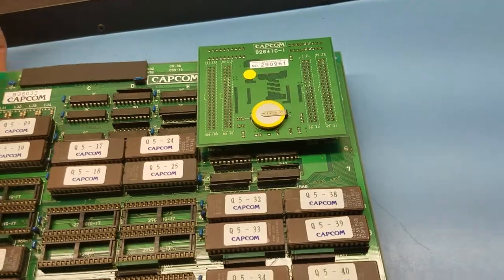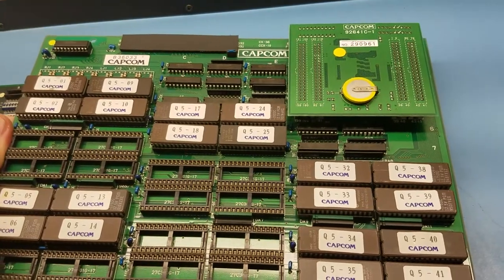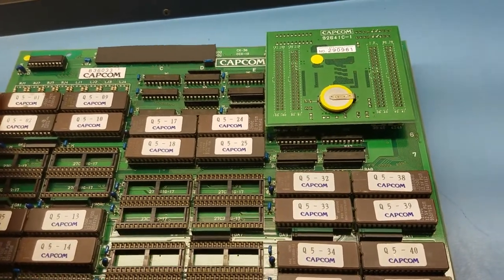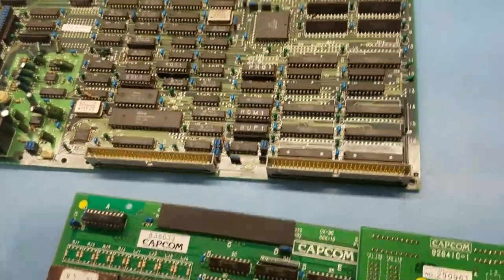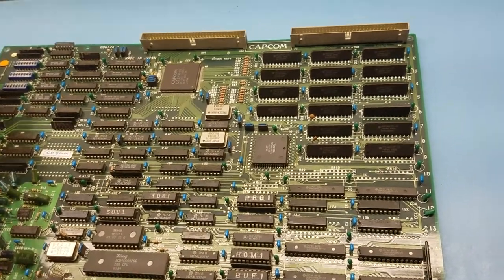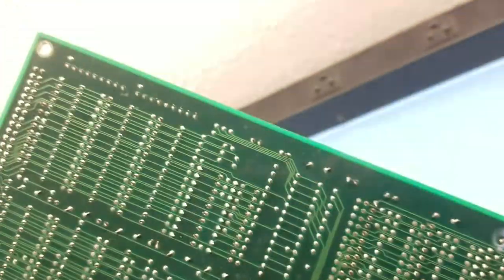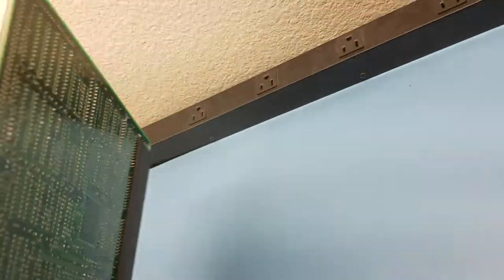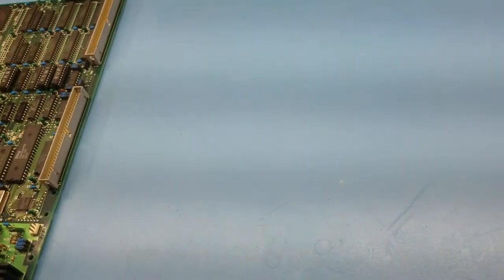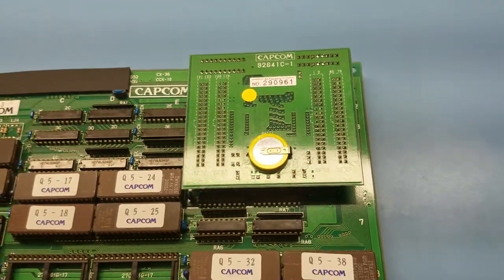This board was recently acquired off of eBay and it's nice and clean. It was sold as non-working, but when I first received it, just to see what it would do, I powered it up and my power supply was short-circuiting. I did some digging and found that those two leads were crossed, so it was a dead short on my 5 volt supply. That's probably what originally caused the operator to stick this thing on the shelf, and then eventually the battery died — just that simple issue.